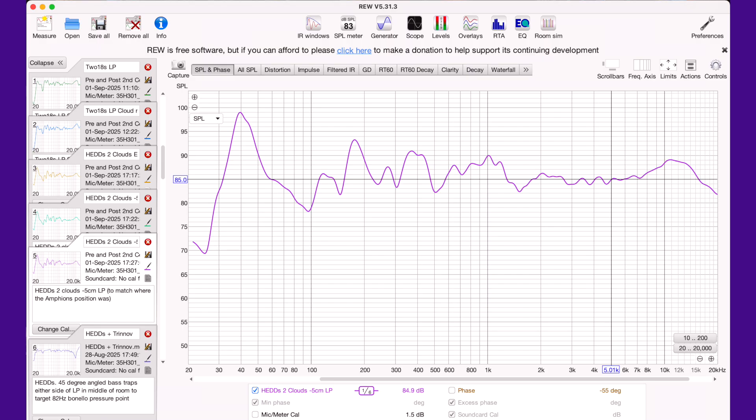I then added another panel just behind the listening position to see if it would take away another decibel — that didn't actually do anything else, it was ineffectual. What I've learned is the first reflection points are of absolute paramount importance. Adding bass trapping to the back of the room — 40cm thick soffits, sometimes distanced off the wall — made the nulls worse every time but did improve the decay time. It's a toss-up: your ears can get used to frequency discrepancies, but you can't tune your ears to inaccurate time delays and phase issues. Getting the first reflection points covered and the decay time down is paramount for your phantom centre, stereo imaging, and depth of sound.